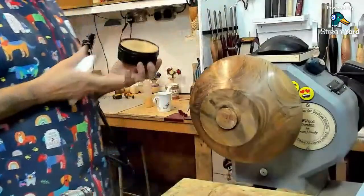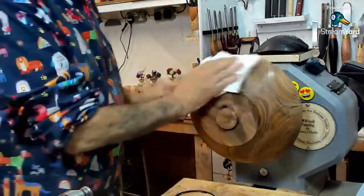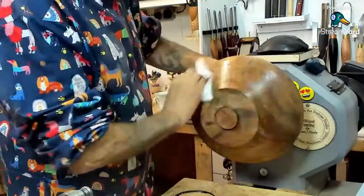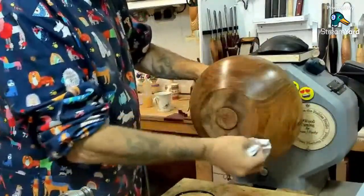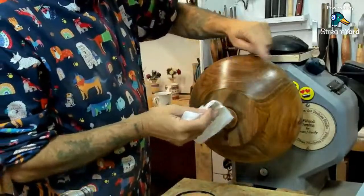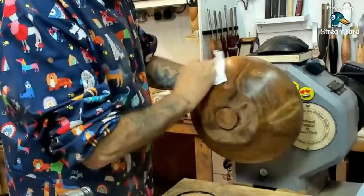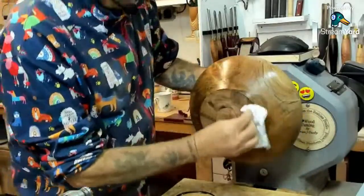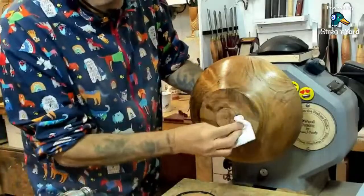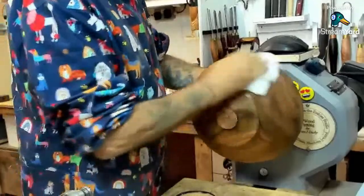Doug Miller's in. I aim to cut it to a wall thickness such that it will not crack — keep your wall thickness even all the way around. So a little coat of Yorkshire Grit. There is a ring shake — this one here — which was probably caused when the tree fell, or it was caught in a violent storm that broke one of the rings. Mostly storm damage. That's what's called a contortion — when the wind twists the tree. That's what mostly causes ring shakes.